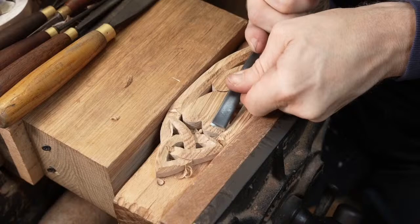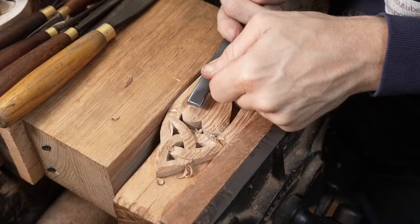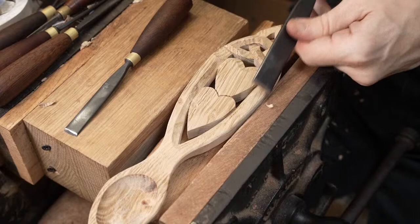So there's two things when it comes to tear out with that particular type. One is how you've marked it. Ideally, I'd have marked it completely straight, but it's not always possible or practical. The other is when you start to feel the resistance of the wood, follow what it says.